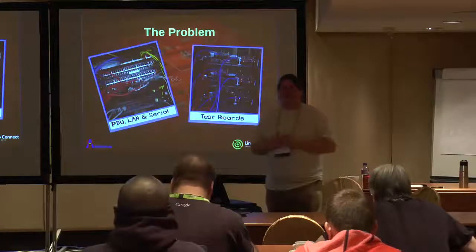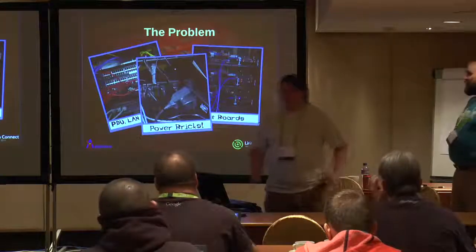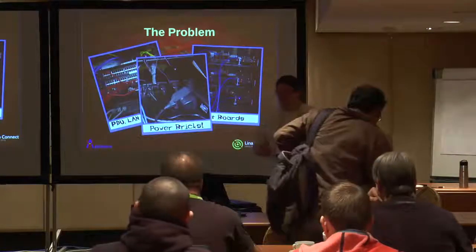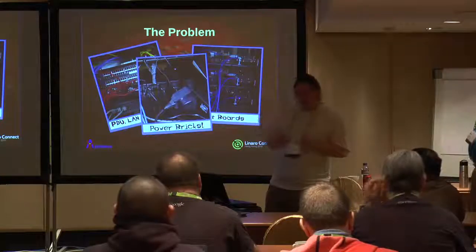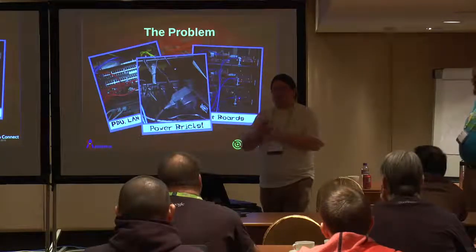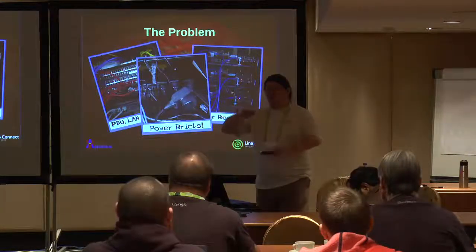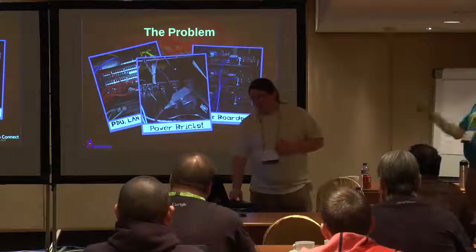You end up with also an awful lot of test kit or support kit just to have your rack of units. And then there's the power bricks. We mentioned that there needs to be a power distribution unit, something you can turn power on and off, but test units typically are small target boards. They might have a power brick. That's not too bad. PDUs come typically with an IEC power connector on them. That's okay. But what if your power brick is an integrated wall-wart power supply? You're certainly not going to be able to plug that into your PDU, so you end up with a power socket on a lead, then a power brick hanging off the power socket. So you've probably taken 3U of shelf space just to put the power supplies. And that's one per device. If you've got 20 devices in the rack, you've got 20 power bricks or 20 leads hanging off.